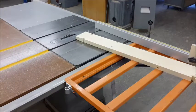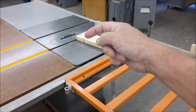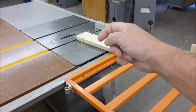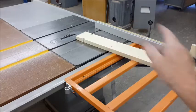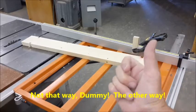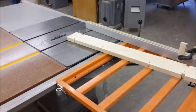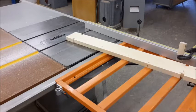So there it is, milled out, and now all I got to do is nibble out from the end of that notch back this way 5 inches and reset the stop block, in other words 5 inches this way, and nibble out in between, and we'll be ready to put the legs together. See you in a while.